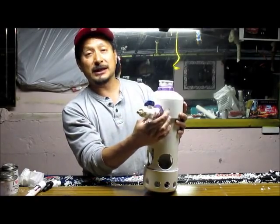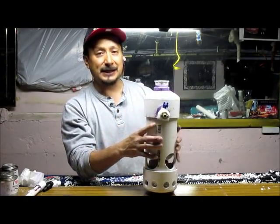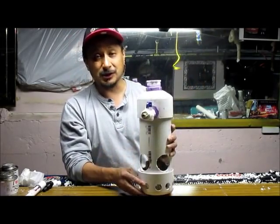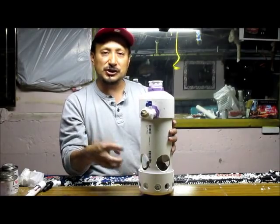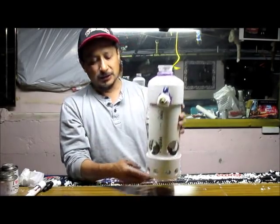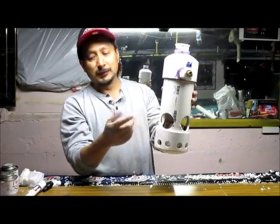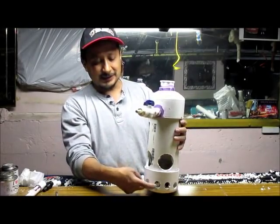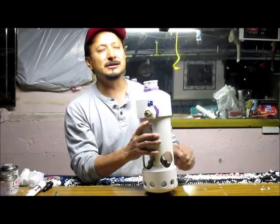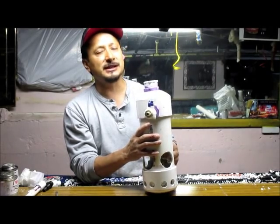If it does leak, this is the one I want sealed, because the inch-and-a-half pipe is inside the tank. One extra thing: I didn't drill any holes in the bottom. People say you want to pull sediment off the bottom, but I didn't want any jagged parts that could puncture or mark the pond liner. So I drilled two and one-eighth inch holes around the sides — there's going to be enough water flow there, since water finds its way through like air does.